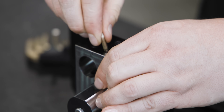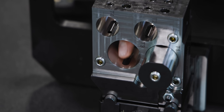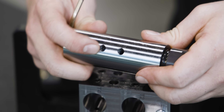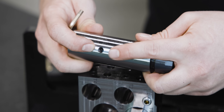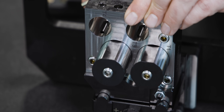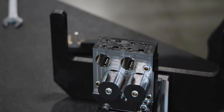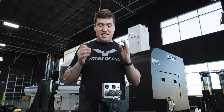When I break this loose and take my ID tool out, you'll notice there's a slot inside the station. You'll also notice on the tool there are holes right here. Depending on how far you want this to stick in or out, you'll either plug or open this set screw — either way it doesn't matter. The second I put this into the station over that slot and tighten it down, it's got coolant through. The coolant's going through the whole holder — that's all you have to do. That will save you so much time and headache, it is insane.